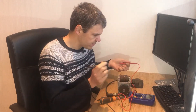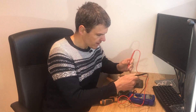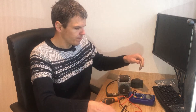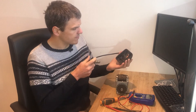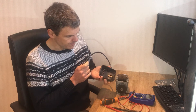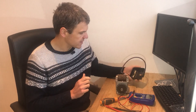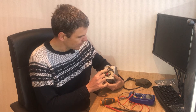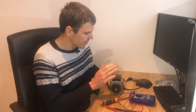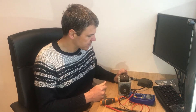The reason is that the coil is not working. You can see here the original coil that came with the magneto - it's probably 60 years old. I've got my tester here and if I try to test any of the points, I'm getting absolutely nothing. Basically the coil is RIP. Even though I've put a brand new HT lead in the assembly, and I set the points, cleaned them up and set them at the right gap, I think the coil is just not good enough.